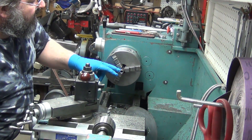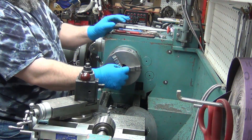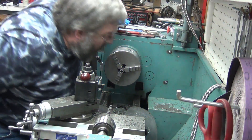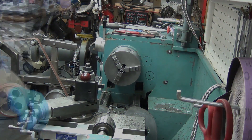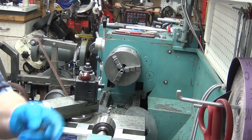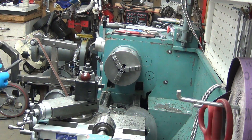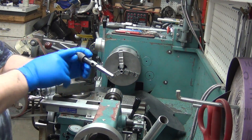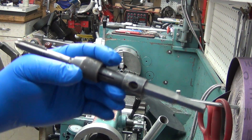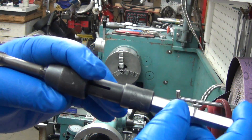I'm going to leave the outside rough — in fact, push comes to shove, I'll knurl it to get more grip on that urethane. Luckily I had a half-13 tap and I've got plenty of half-13 bolts. This is just a regular tap holder, the kind that normally has a bar going through it.